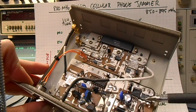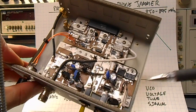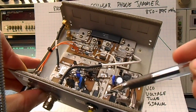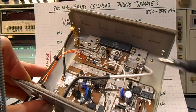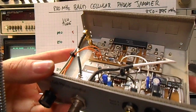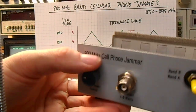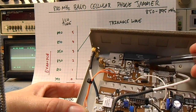This is a 10-volt voltage regulator with excessive noise filtering. I did this in case you want to power it off a vehicle like a cigarette lighter — the power supply tends to be really noisy, so you want voltage spike protection and a fuse. You can run the power module at 10 volts if you want to lower the RF output a little bit — it'll also reduce the current draw. At maximum RF output the current draw is around 2 amps for about 8 watts of RF output. There's a potentiometer on the front for the RF power control, and you vary the output by varying the voltage on the power control pin.